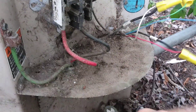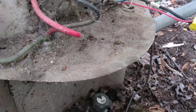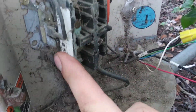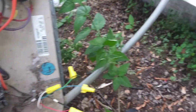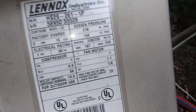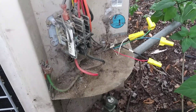The capacitor doesn't appear to be bulging. I removed the old wire — it's floating down there, I'll tie it up. This is the main thermostat wire coming in to send the 24 volts here. I'm getting 24 volts at the board on the furnace, so that's good. The furnace was replaced in 2019 according to the manufacturer date. This is the info on the Lennox right here if you're curious — it uses R22. Let's go inside and wire it up.